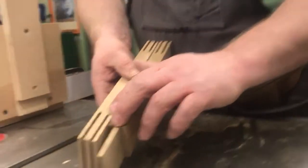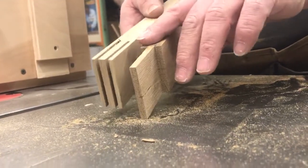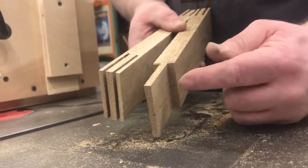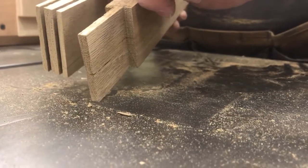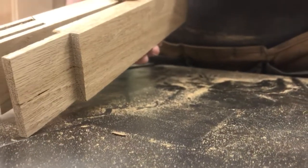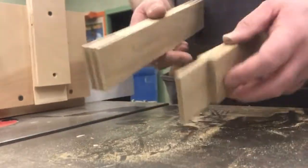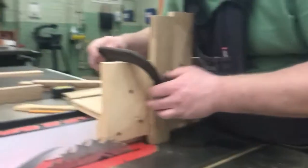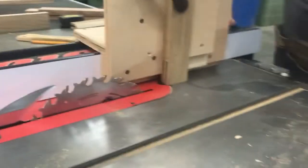I have finished taking my inside cuts to finish the thickness of my tenon on this bridle joint. If you recall, the first way I established that thickness was to move from the outside and go in, then I left my fence set at that. So I've taken all of those cuts now. I'm going to go back and clear this out. There are a couple different ways people can do it — I'm just showing you the way I do this.